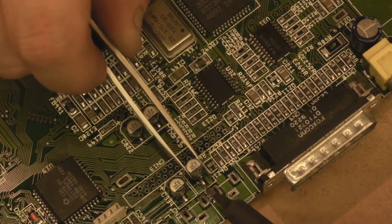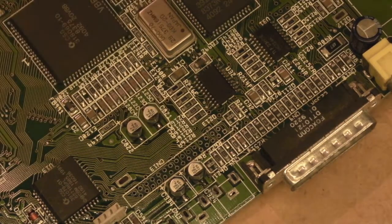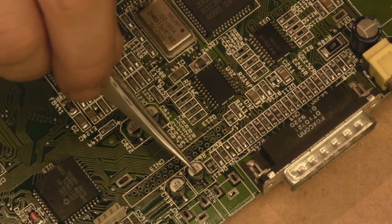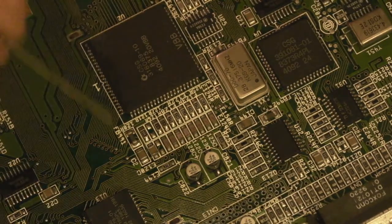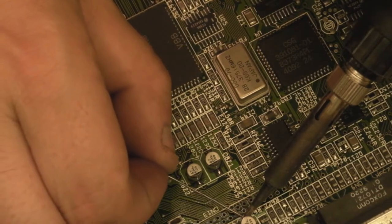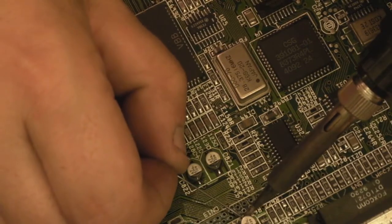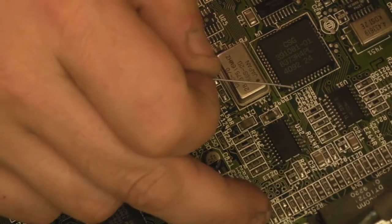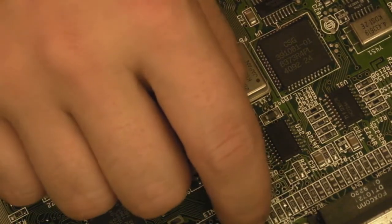So what we do is we get our capacitor lined up. We just touch the pad, make the solder molten, let go, and that's it. So it's perfectly soldered on that side, really. And then, just as I've done in the past, we're going onto this side and solder it in place. So we go in here now, and we can just solder the capacitor in place. Let's add a tiny touch more on there. There we go. And that's it. No, I'm quite pleased. I'm quite impressed with that technique. That works really, really nicely.